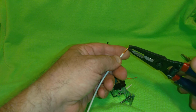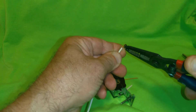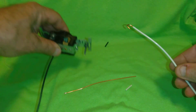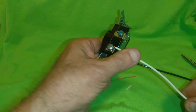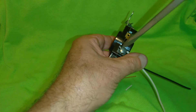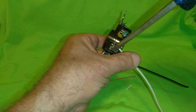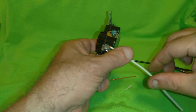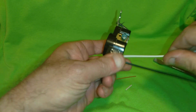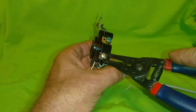The white goes on the silver screw. I'll make a loop in the direction that the screw turns. I'll show you why you don't put it around the screw counterclockwise — when you put the wire around counterclockwise and you're turning the screw clockwise, that will push the wire out and open the loop. So you take and you put it around the screw clockwise.